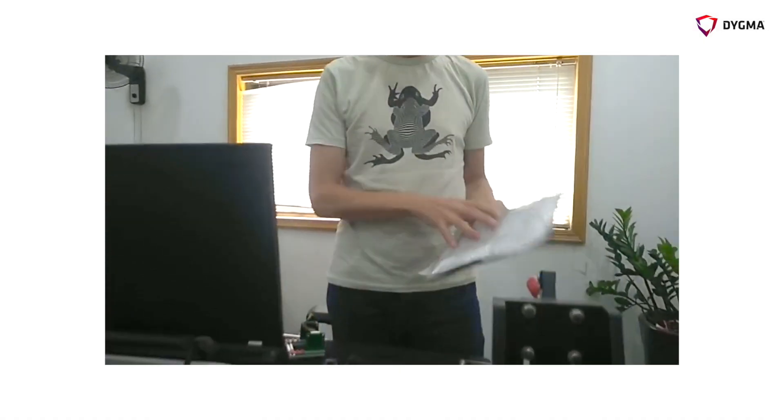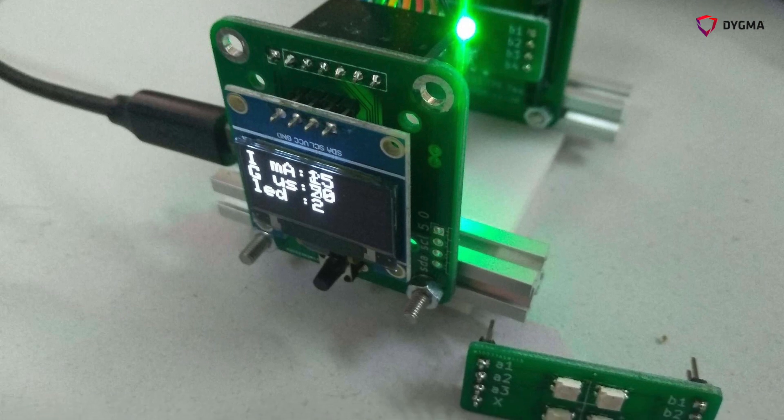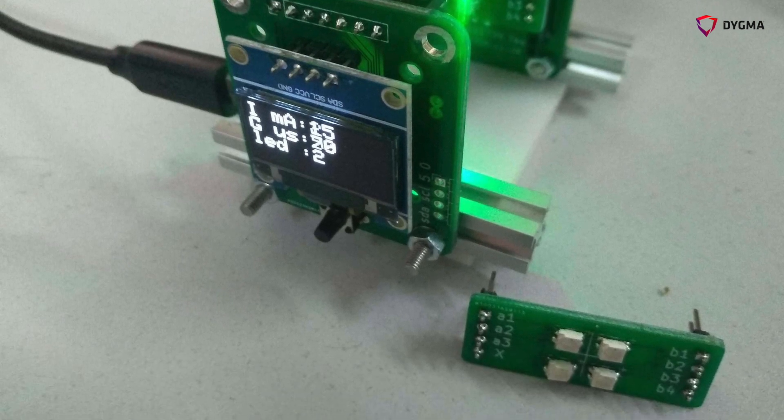We've got the LEDs — this is just two of ten bags. I took two from the PCBA and they said don't open them until the latest moment that you can. We're going to be assembling tomorrow the first hundred from the MP, and I need to validate these. You might remember I made this test jig — we have a little test board and we check the wavelength of the LEDs, that it's all still what we expect, because we don't want to assemble those boards with the wrong flavour LEDs, the wrong light output.